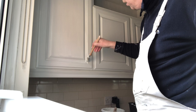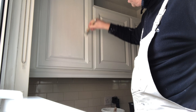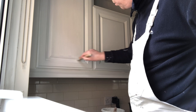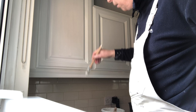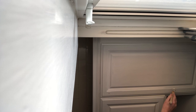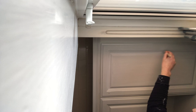Just a nice smooth finish. Like I said in the video yesterday, you have to live in your home — it's a kitchen. It's not supposed to have big thick brush marks, big thick roller marks. You really do need to have a nice smooth finish. And all those things I suggested: clean down, use a good primer and real good quality paint. When you put that paint conditioner in, it gives you plenty of working time with your paint — it won't dry quick. You've got working time so you can actually get to the edge of the door.